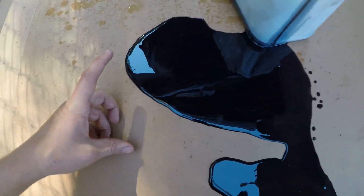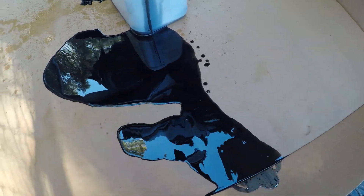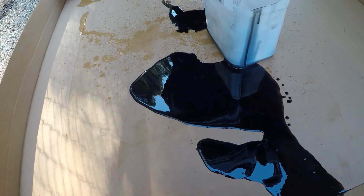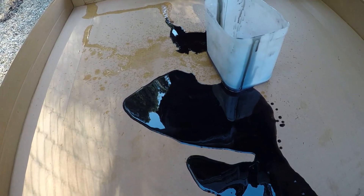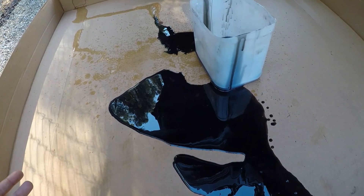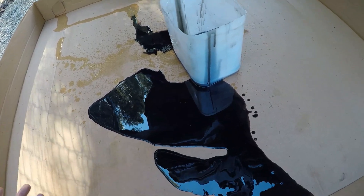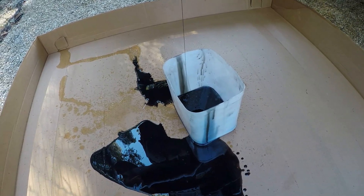I'm pretty happy with the way the oil looks — I can see a little bit of a sheen here that might be a little bit of water, but obviously not enough to mix with the lubrication properties of the oil. That's why it's good to keep up with this oil change, because its job is to lubricate but also to keep it cool, and water will make this stuff foam up really bad. That's the reason why marine gear oil is different than what you'd put in an automotive differential — it's designed to maybe get a little water in it and still help lubricate. I'm really happy with these lower units; I think they're in good shape.